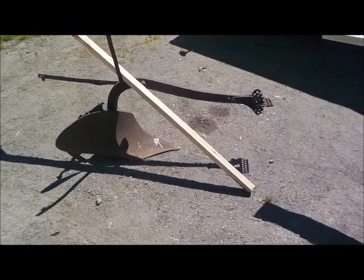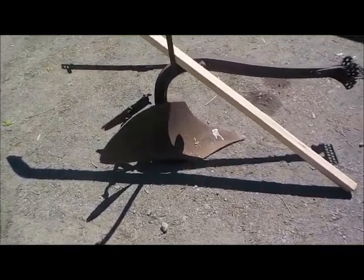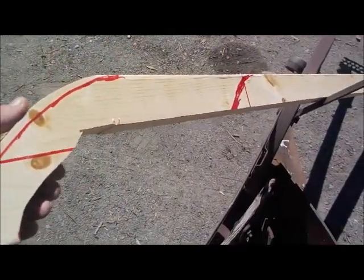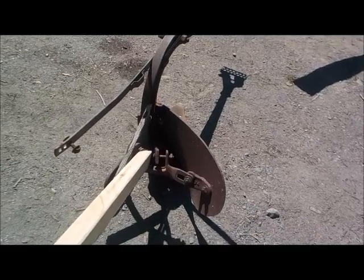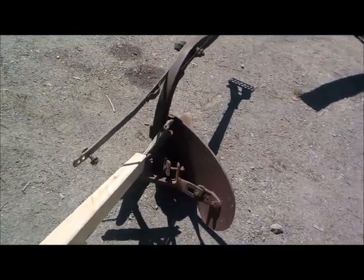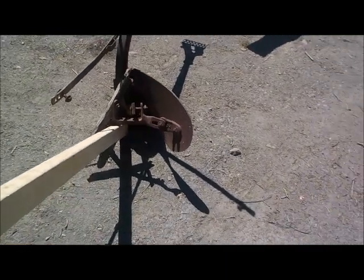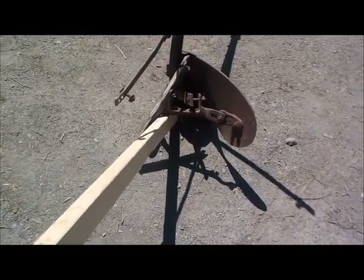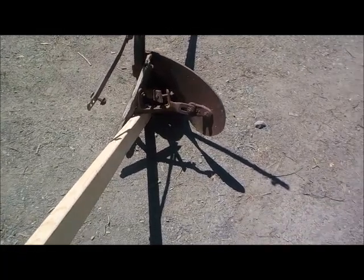We finally got some dry weather here and I have time to do this. I'm cutting the handles for the walk-behind Syracuse plow — I made them out of pine. This was the first rough cut. I got to get a measurement: it's got to sit down inside that slot, and then on that side too. I'm trying to get a measurement on the handle, see how far back I should be — I cut them purposely too long. I'm using a David Bradley as kind of a template to get the idea of exactly where and how it should be.